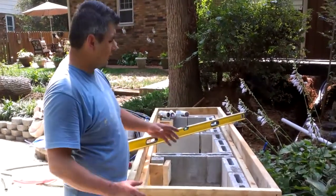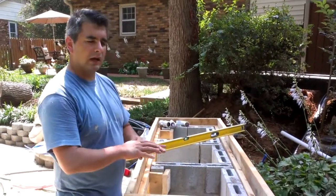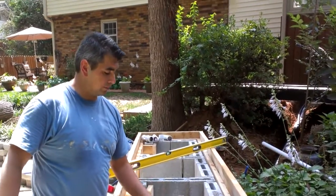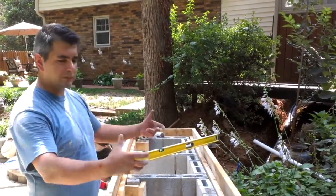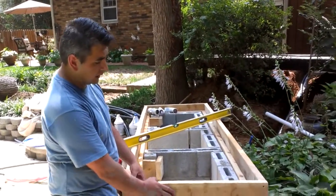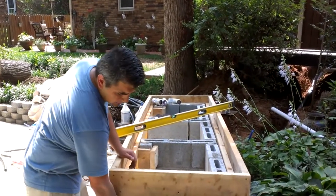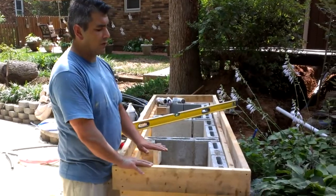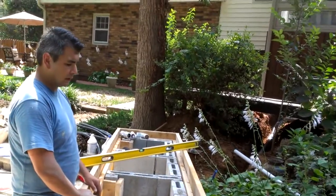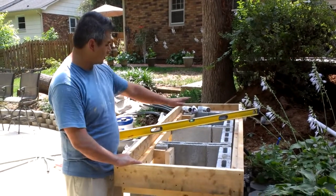We actually created a 1.5 inch lip around the main structure to overhang or overlap the regular base. So it's going to be a nice border of around 1.5 inches because of the 2x4s. Now these 2x6s are giving us the thickness of the concrete slab. By adding these pieces, I want to come to about 36 inches, which is kind of standard height, so people are not bent over or working with difficulty. So we are putting this structure like that.